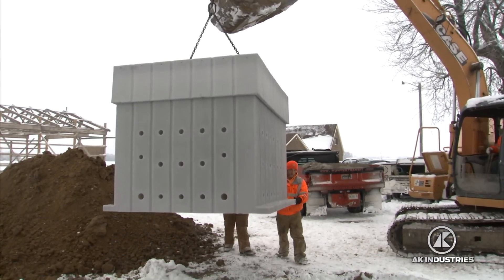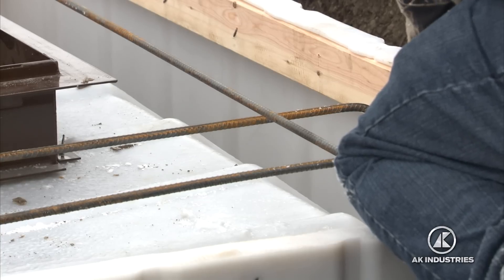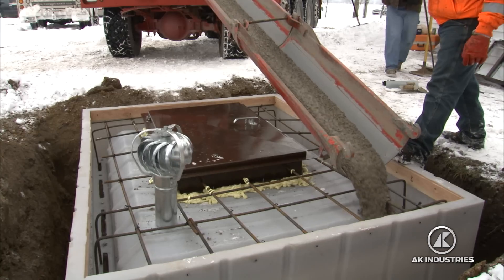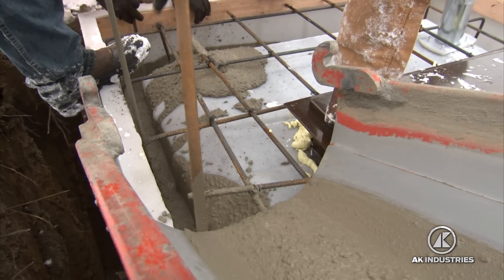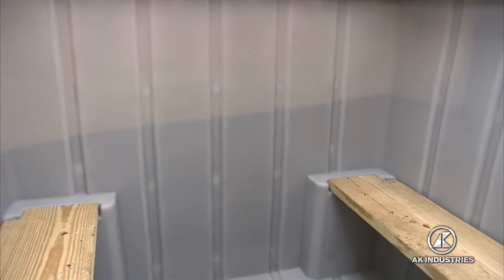The shelter can now be lowered into the ground and previously cut and shaped rebar is added in cross sections. The internal walls and lid are filled with concrete. It is important that the concrete not be too viscous so it is able to flow to all corners of the shelter.